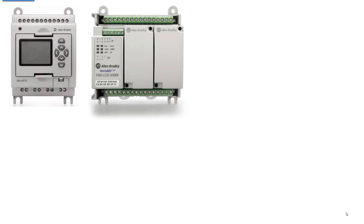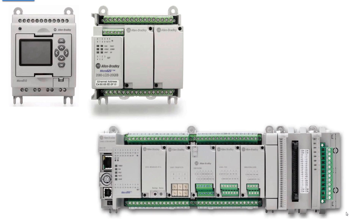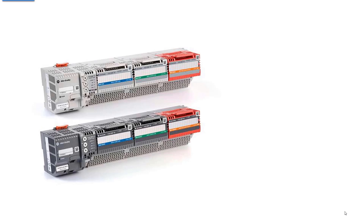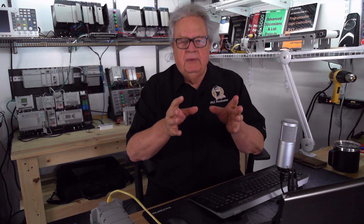On the upper right, some have connectors that slide from one module into the processor with a little tab you roll over to push the connector in. You also need an end cap for backplane termination. This is the more current Micro 800 family: the Micro 810 takes a special USB adapter that costs $40. The Micro 820 has an Ethernet port at the top. The 850 has Ethernet IP, an RS-232 round DIN connector, and USB, plus a mode switch and snap-in module covers. For ControlLogix - what Rockwell calls a PAC, a Programmable Automation Controller - this platform is anything you want, anywhere, for any reason. For remote IO, Flex IO and Point IO both have an adapter on the left end for the network, whether ControlNet, Ethernet, Data Highway, or others.